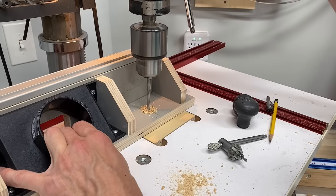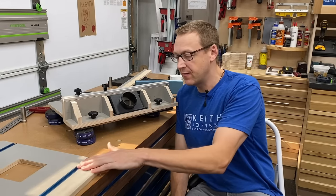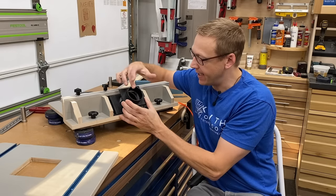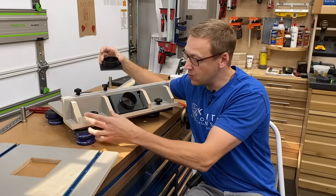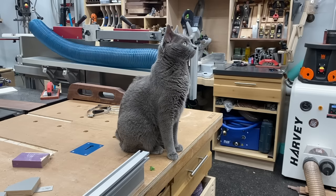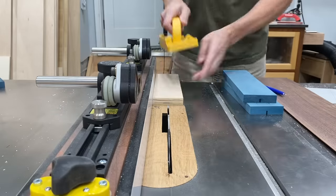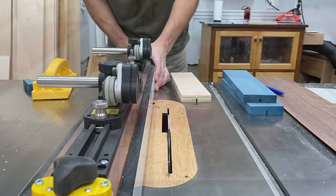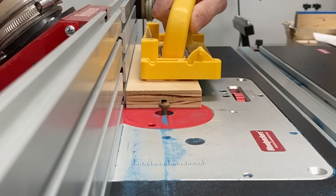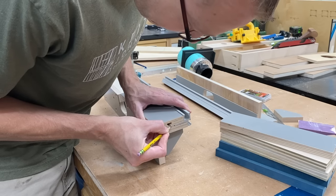More holes — these will access the T-bolts in the T-track so knobs can tighten the fence down to the table. For the second fence I'm making some alterations to the back: I cut the dust port down and embedded it in a piece of plywood so I can move the support brackets in and gain a little more room. Moving on to the adjustable fences — having fences that can slide in and out based on the size of the bit you're using is very convenient; you can also use them as a zero-clearance fence. To cut the T-track slot I first cut out the waste on the table saw, then use a T-slot bit. I'll put a link to a higher-quality bit in the description — no-name brands are not recommended.